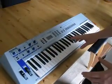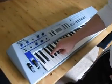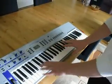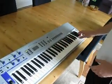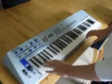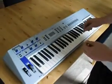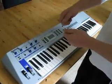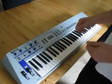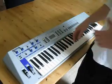The problem with it is some of the keys are dead and it goes into a pattern — the F sharp and G keys repeat dead across the keyboard, four keys in total. Because it's in a pattern like that, it's not just a single key that's dead because they wouldn't all go out at the same time. What probably happened is there's a ribbon cable that attaches the keyboard to the circuit board that likely came loose. I had just played a gig, been banging on it a lot, and it got jostled around coming in and out of the car.